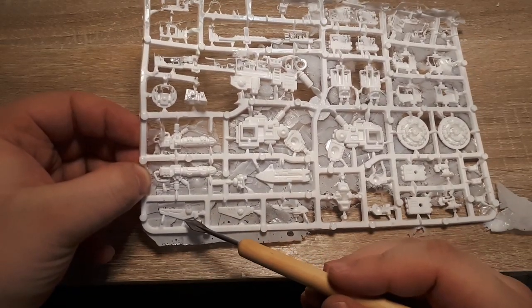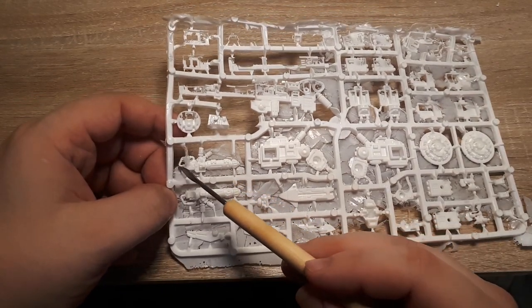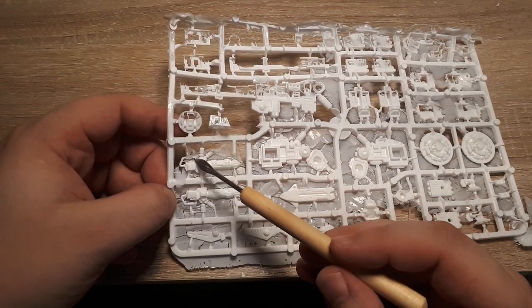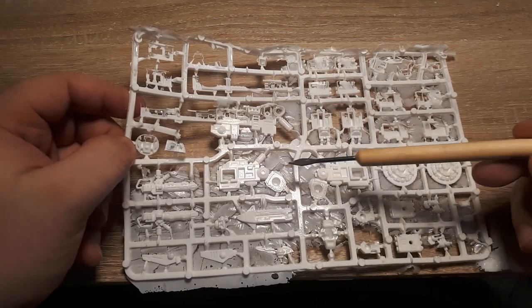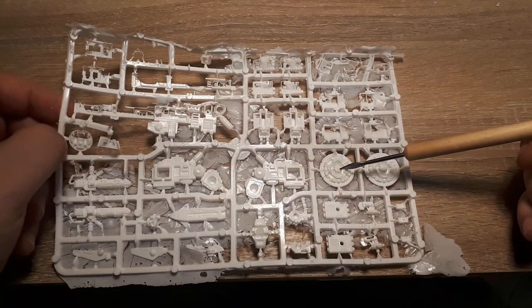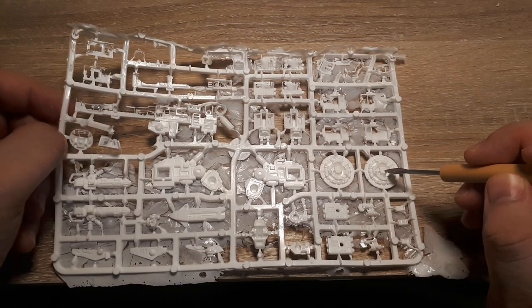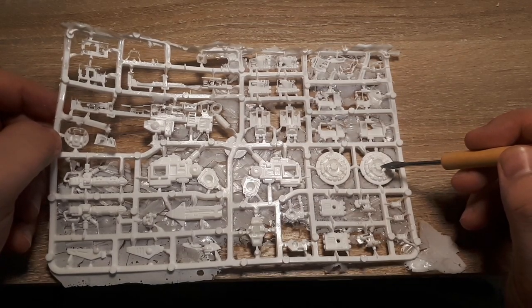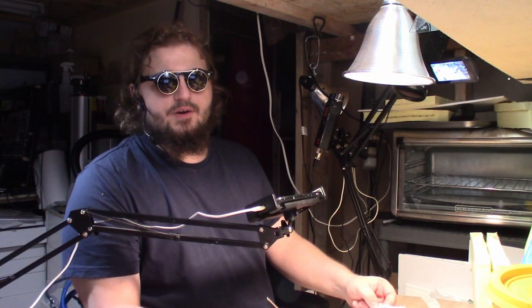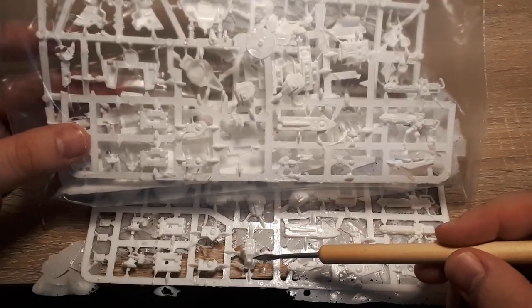Alright, we got this piece back, we got this piece back. These two guns actually ended up casting quite well. Still a little bit flexible, I think I pulled it out a little bit too soon, but I'm impatient. This is intact, this is intact. This recast perfectly, this one did too. There's usually a problem with the holes, these deep holes where you put in the rod that attaches the drone to the base. These always don't get cast very well, you just gotta use some glue on them or a Dremel tool. This piece is actually attached.